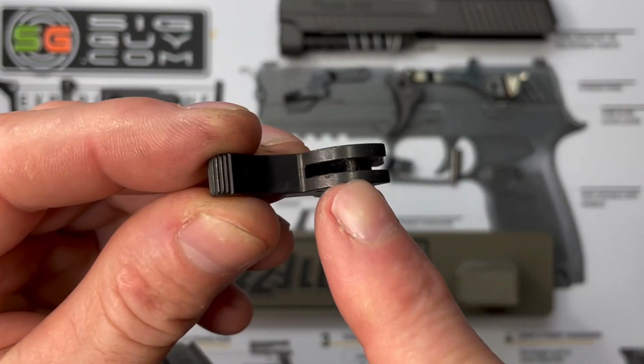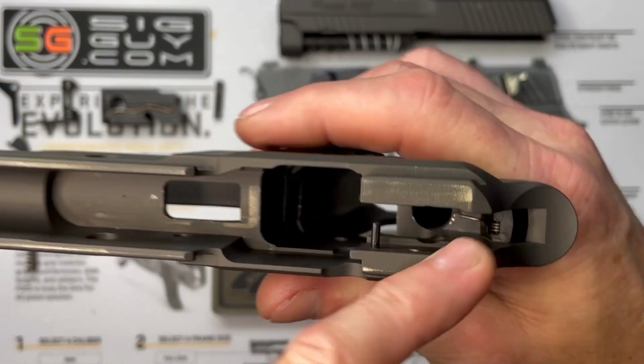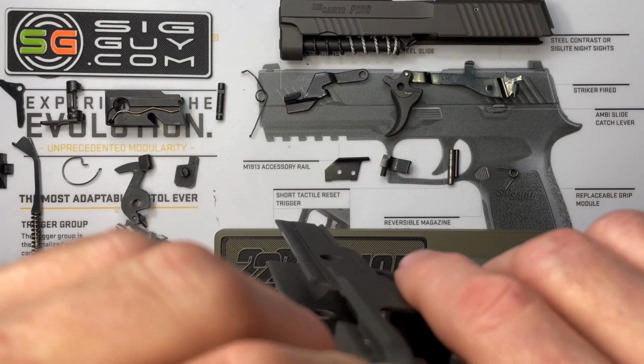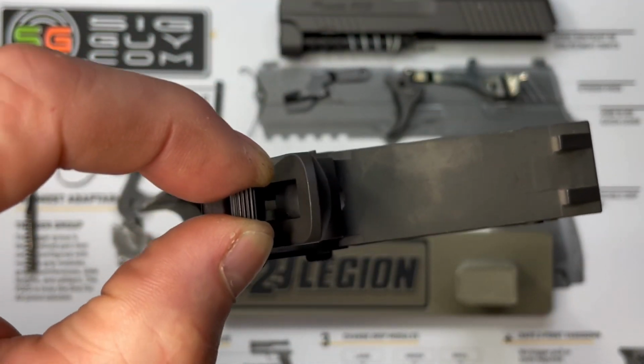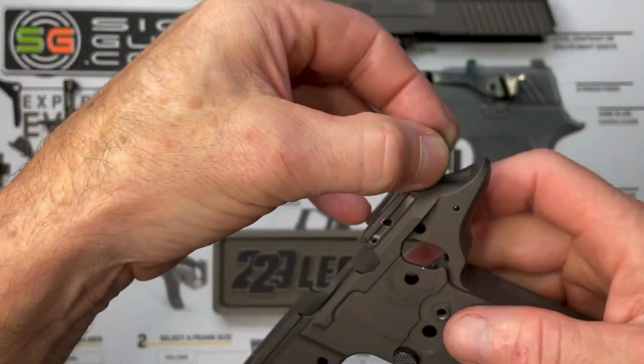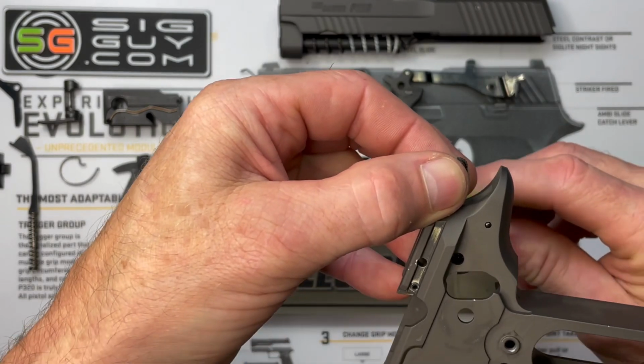Our hammer's got a little pin underneath here, inside in the middle. There's a little spring on the inside and the back here. That pin needs to be underneath that spring. So if you install it, and you can hold the frame just by holding the hammer, it's installed correctly, okay? Next, I'm going to use my 4mm punch. I can see completely through my frame.